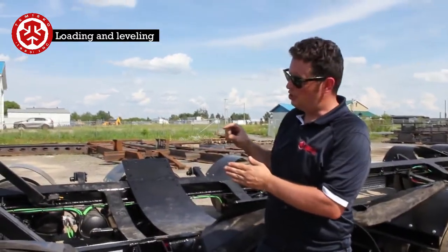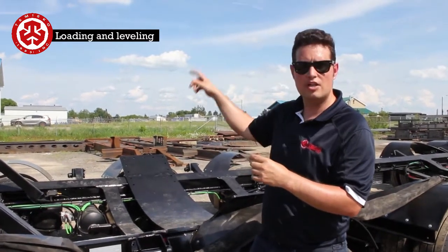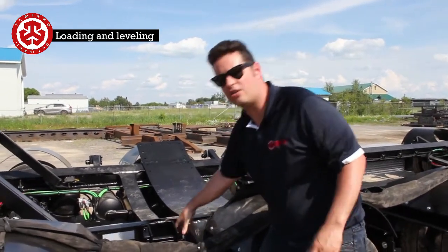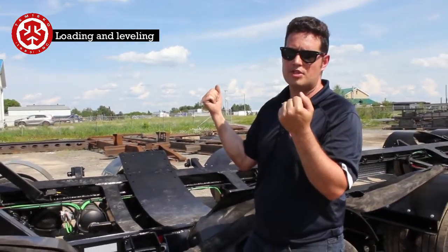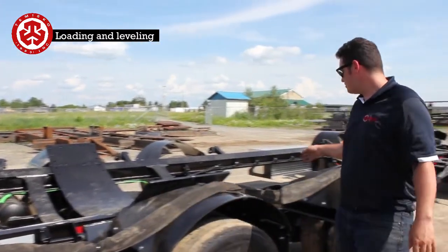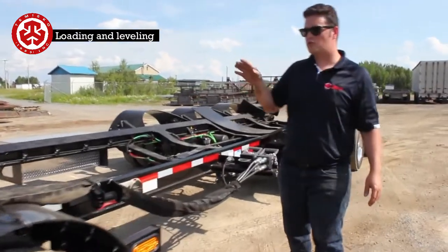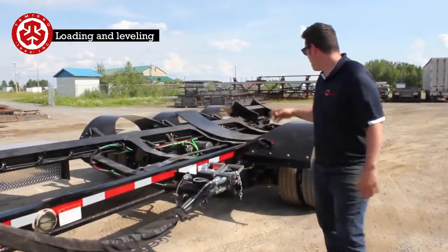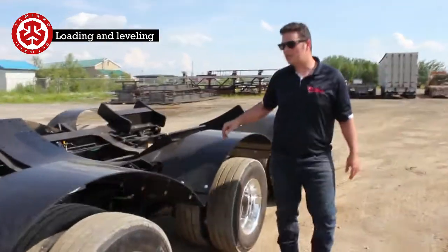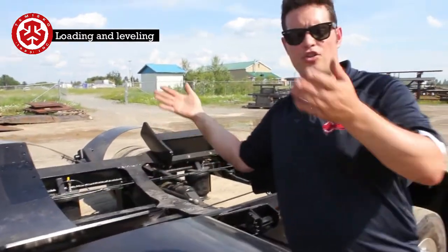A lot of guys have a strap with a sock, like a drainage sock, that goes all the way around, so when you tighten this down, you're not going to wind up scuffing the tower. Every single one of these needs to have a strap in it, so there's going to be 6 straps along the whole length of the trailer. In here you're going to have some more carpeting underneath to shim the tower.